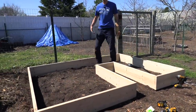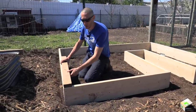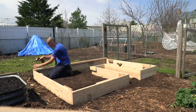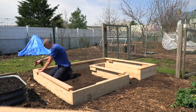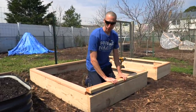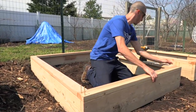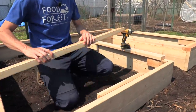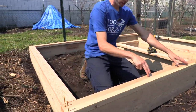You can see just how much more space we're going to be able to utilize in here. Next, I'm going to take 2x4s and cut caps to put on the top like this. This way it locks the whole thing together, and it also gives me a little area to rest on or sit on when I'm doing some work. Here's the final cap. After we get this in, the construction will essentially be done. I've got these braces that I'm putting in so when I put the cap down, it doesn't just buckle in — I have something to actually screw into.